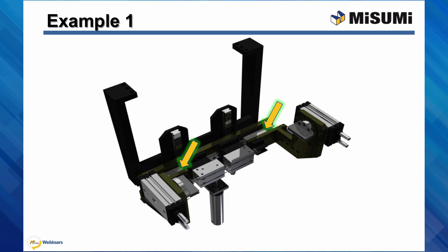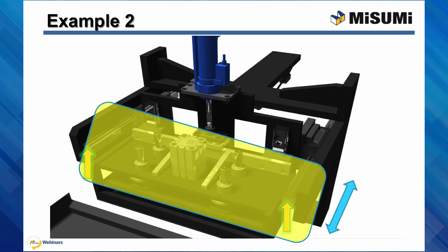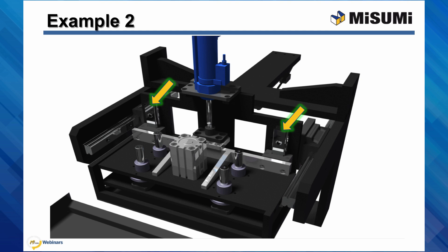Some customers have implemented a workaround by inserting a long stroke of the guide after a certain number of short strokes. The idea is that the long stroke re-indexes the bearings, thereby preventing wear from accumulating on only a select number of bearings. Much like the first example, this also has two sets of linear guides. In general, linear guides can take more moment loads than a linear shaft and ball bushing. This can result in simplified designs using one linear guide block instead of a pair of linear ball bushings.